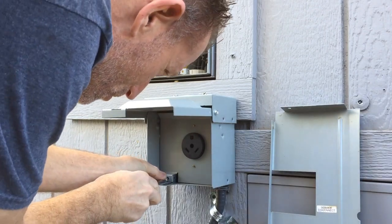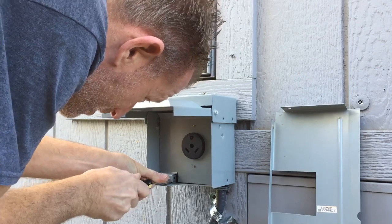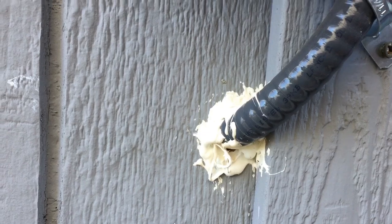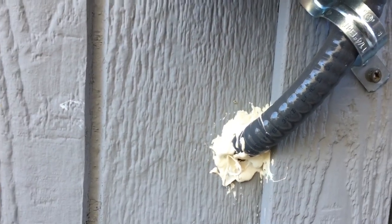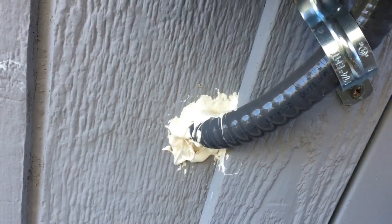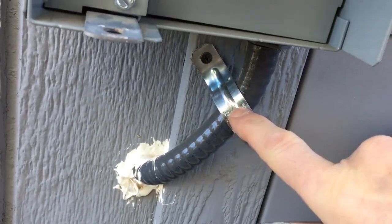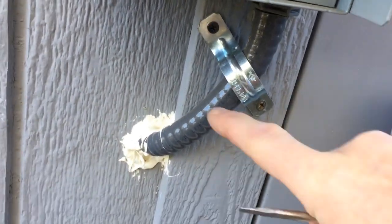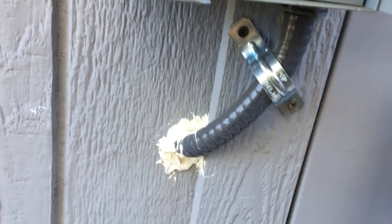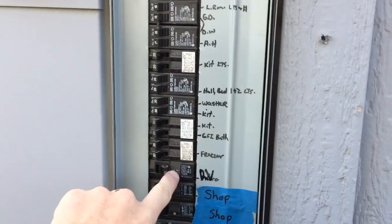Then it's just the one screw for mounting. I ran a bunch of caulking in there — I haven't painted any of this yet — but just run some caulking in there so it's watertight. If you want to put a little bracket on there just to secure it, this stuff is super stiff so you don't have to worry too much about it.